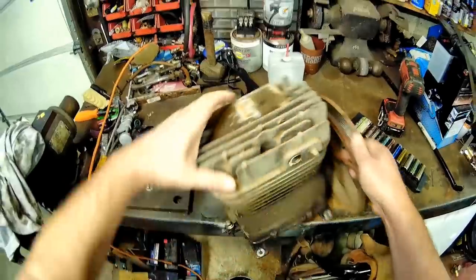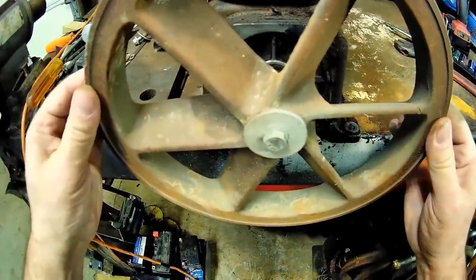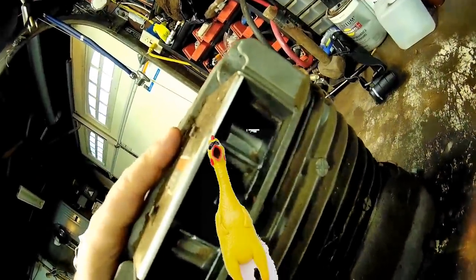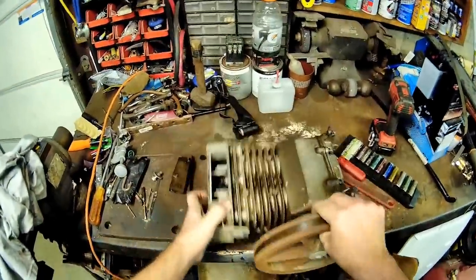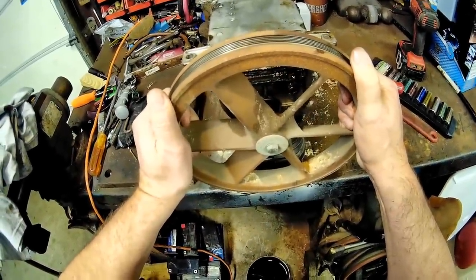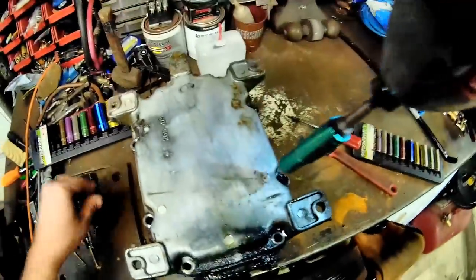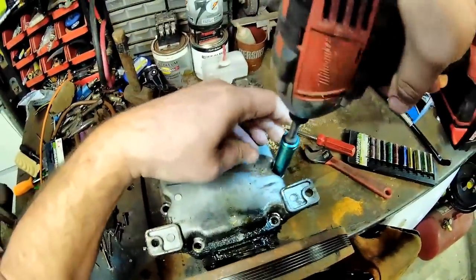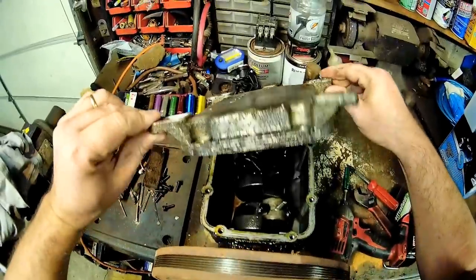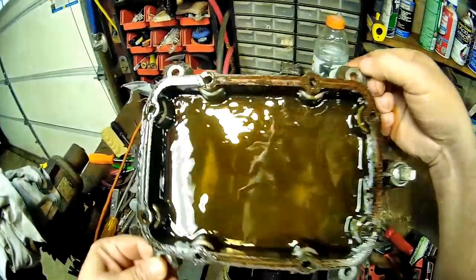Well, I won't have to worry about that anymore. Look at this. Guess the next thing I gotta fix is my noisy furnace. The reeds are still good. That's how much slack that connecting rod has right there. See what it looks like in here — looks like that seal's been leaking. That's where all my oil's been coming out. A little bit of metal in there.